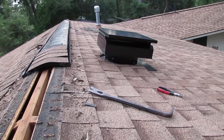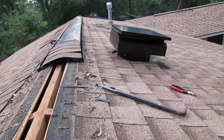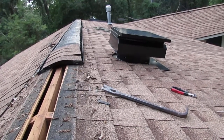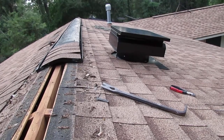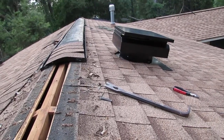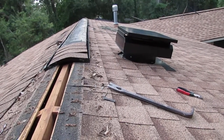Even after doing this, I still may have to add a few more of these, because the only way to know if you have proper ventilation in your attic is to monitor it over a period of time. The best way to do that is with one of those wireless monitors — you can get them off eBay, Amazon, Lowe's, or Home Depot. If your attic temperatures stay 10 degrees above the outside temperature, that's when you should start considering additional ventilation measures.